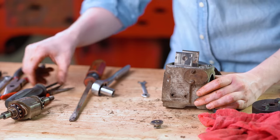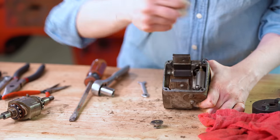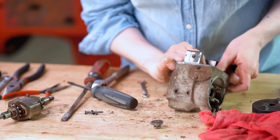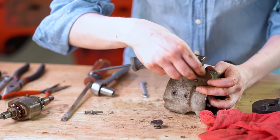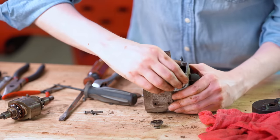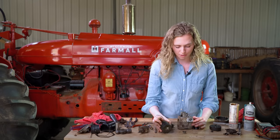There are two screws for the door and one screw that holds the clip which keeps the condenser in — it's a little unusual how it all fits together but that's how it was designed. With that clip out of the way, I'll take the door off next with just those two screws. With the door off, the condenser slides right out. The condenser does go bad from time to time so we'll put a new one in, and pulling that condenser out freed up the wire so the coil can come out the rest of the way.